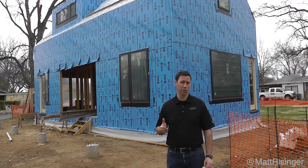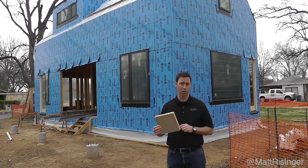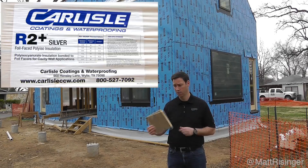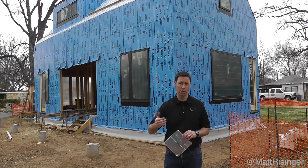The concept on this house is that it will actually have no inside insulation. All the insulation is going to be outside of the CCW 705, so we've got all exterior rigid foam. We're using Carlisle's foil-faced poly ISO — four inches on the walls and six inches on the roof deck, with no insulation on the inside.